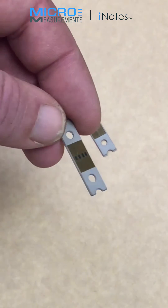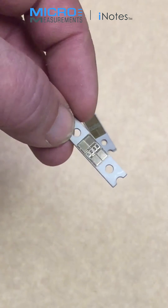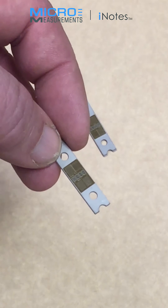These are produced from thin metal shims. This can be steel or stainless steel alloys — anything that's a good spring element. And the strain gauges can be anything in the Micromeasurements line, including the Micromeasurements advanced sensor strain gauges.